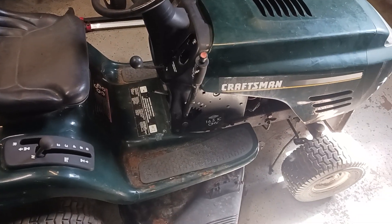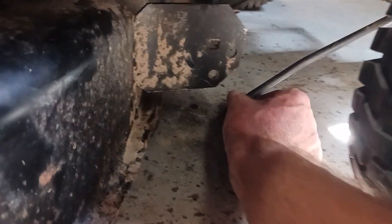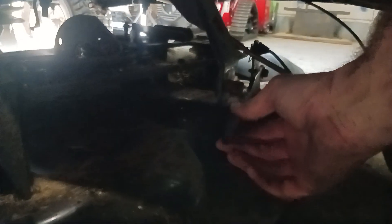The deck's already been off so I just have it sitting there. You want to go ahead and pull all your pins out — these go inside the belt. Drop your deck, take your belts off. You got that one, and you have the one in the middle. Make sure you drop your deck so you can see to get those pins out. Over on this side you got the two pins up front, the one in the middle, and you do have one that runs to the back right here. Make sure you get all those pins off.